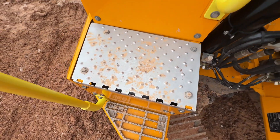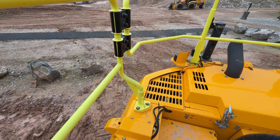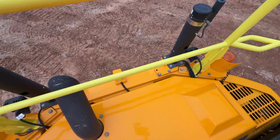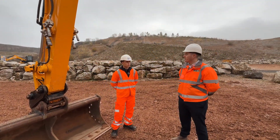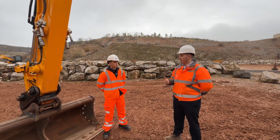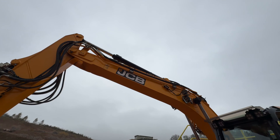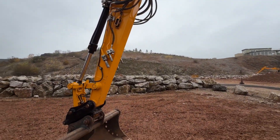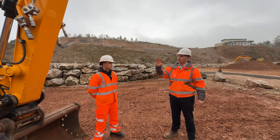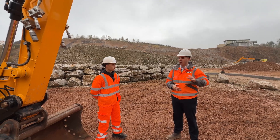We also have the access and egress points on the side, and this boom comes in three different variants. The machine here today has a mono boom, and it will also be launching with a TAB boom — triple articulated boom. For dipper options there are three: a 2.5m, 2.7m, and 3m dipper. The machine is also fitted with high and low flow pipework, and we have many hydraulic options available — for example a hammer line, hammer auxiliary, merge circuit, case drain, and our advanced tool selects.